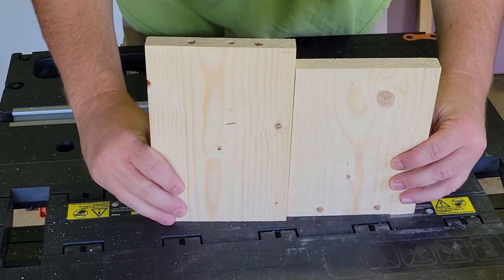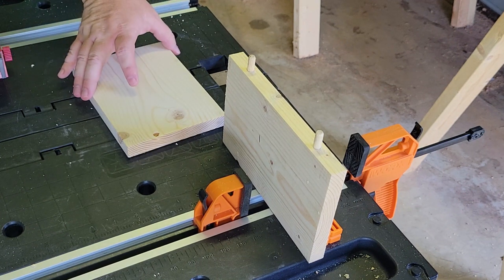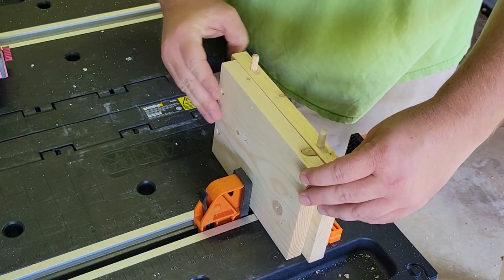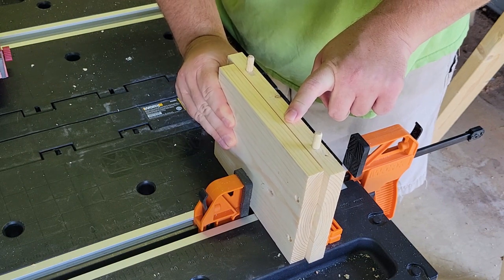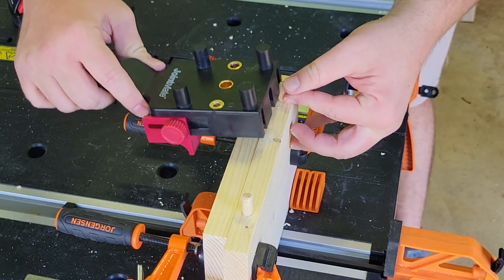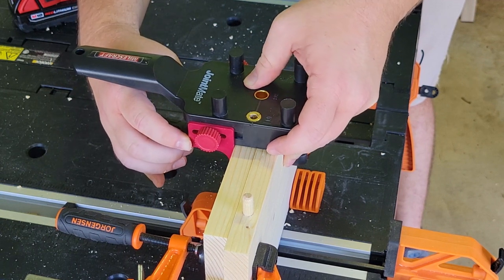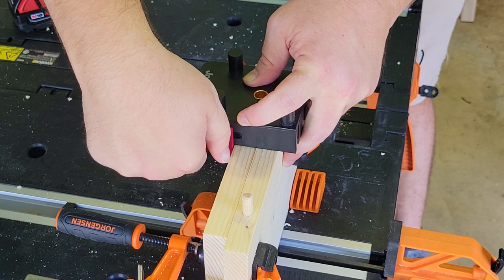Next up, we're going to look at how to do edge joints. Step one for edge joining is to just repeat steps one through nine from doing your corner with whatever edge you're wanting to use. Step two, take board two and line it up how you want it with board one. We've got a pretty gnarly knot there, so I'm just going to flip this over. Step three, clamp it down. I had a little bit of a cupping issue so I've got some more clamps to tighten that up. Step four, find the appropriate slot, slide it over the dowel, push the jig until it stops. Then take your fence, push it flush with board two, tighten it up, then you'll drill your holes.